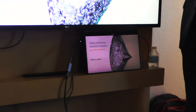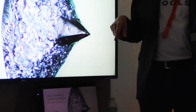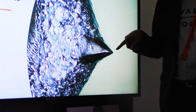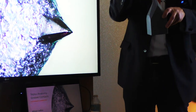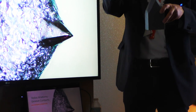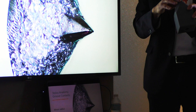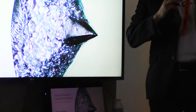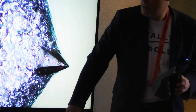The cutting stylus has an effective cutting radius of about 2 microns. So 2.5 microns to 4 microns, we're pretty well there. That's wonderful. The other beautiful thing about these Japanese minor radiuses, because it's a ridge line that they've created, a very complex shape, is that when they wear evenly, they don't change the contact profile. They just wear down at the same profile, and then one day it's gone, and then you've effectively got a conical stylus. Now, the Geiger style, the Geiger replicant style, those are a wedge shape. They wear very quickly. That's the downside of those styli. But the upside is they can be aligned with much greater accuracy on the cantilever than these. There's a cost for everything.